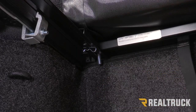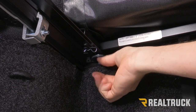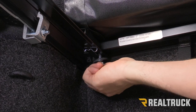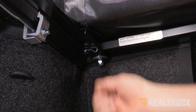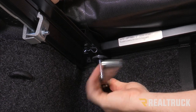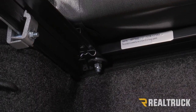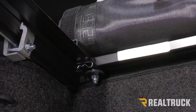Where the bolt drops down through the rail, take the spacer washer from the kit and go up on that bolt. You'll also have a nylock nut. Tighten that down with a nine-sixteenths wrench or ratchet just to the point where it's snug — you don't want it too tight to where you can't move the headrail at all. Repeat the same process on the opposite side.